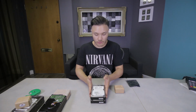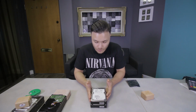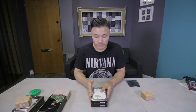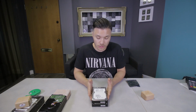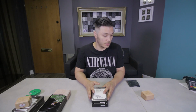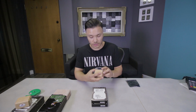Last but not least for today, it's Seagate 7200.12. These drives, everybody who does this for a living knows these drives pretty well, and everybody knows that these drives are really horrible for taking new parts. Sometimes they do require further adaptation of head assembly for adaptive data to be migrated from the donor hard drive and some portions of the ROM in the source drive need to be modified in order to adapt those parts a little better.